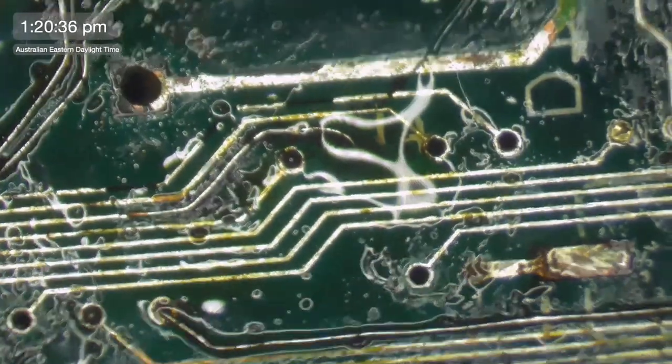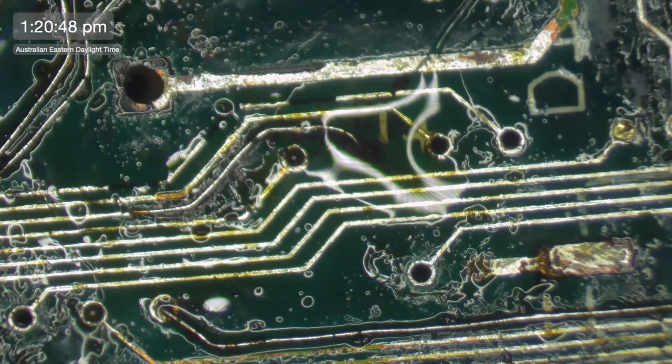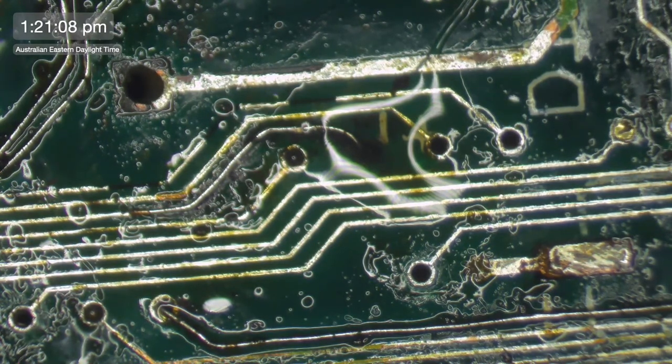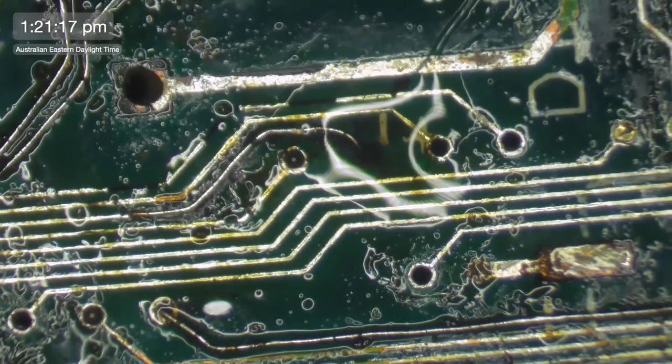I did my very first MacBook Pro repair after I bought a MacBook Pro, a 17-inch one. It's an old Intel Core 2 Duo, 3 gigahertz one, so it was the top spec at the time. It would have been a very expensive laptop when it came out. It didn't work, and I got it really cheap because it didn't work. I basically just followed steps on Rossmann's channel. There was a tantalum capacitor that needed to be replaced, and boom, away she went. That kind of got me into the micro soldering side of things, and then I sort of transitioned that into doing the vintage Mac repairs.